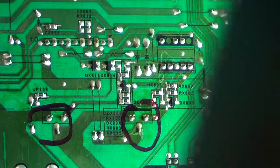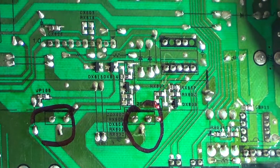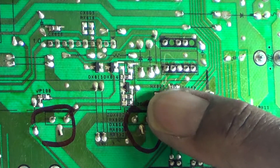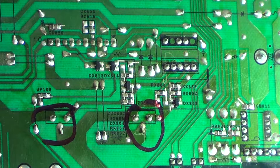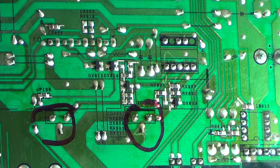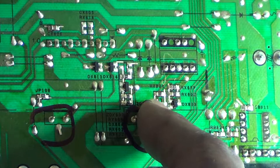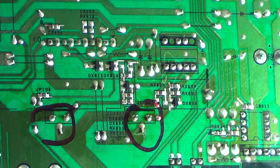I'm going to work on the one that doesn't have any shorts. I also want to show you the bad connections — look at that. Most likely what happens with these sets is the TV will actually play and cut off intermittently, because these have bad connections. What happens is it gets worse, starts arcing, and eventually destroys other components. Remember, this is the one I showed you that was actually blown apart in half, and this other board is also starting to show some bad connections.